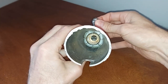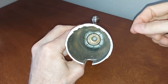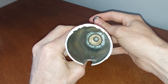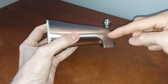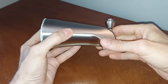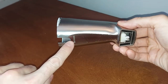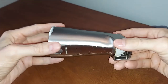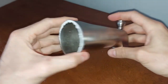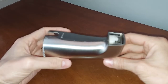When you open this up, it brings a little washer up there and it diverts the water up into your shower head, and when it's down, it would go out onto the tub. So if you have one of these attached with a little screw, you can either unscrew that, loosen it and go counter-clockwise — or if it's threaded like this one, you can just go counter-clockwise and work on it upside down.